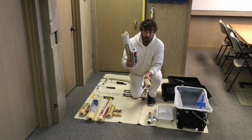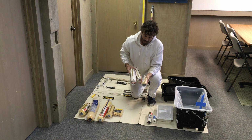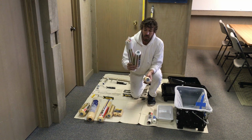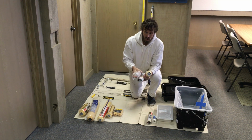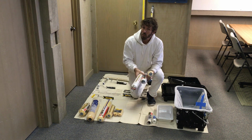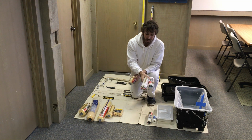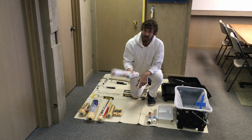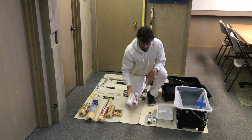These are now called woven covers. So we'll refer to these as woven. It's a little bit different nap or knit on the cover here. It doesn't tend to shed as much. So we will use these on mainly walls. So anything 1/2-inch nap, we will typically just use that on walls only. Very rarely will we use these like on an exterior soffit or fascia. So when we discuss woven covers, 9-inch or 18-inch 1/2-inch nap, those are almost always typically for our walls.